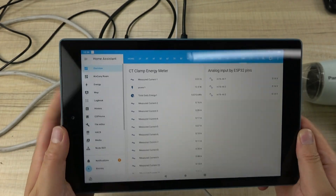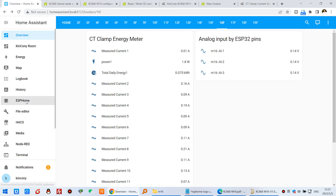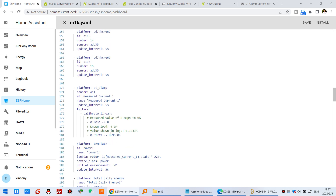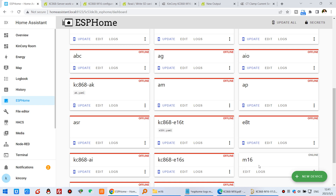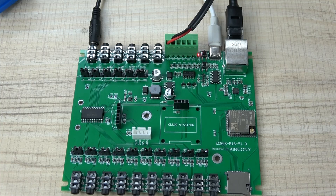This works on the tablet as well. Now I will show you how to calibrate — this is very important. In our ESP-Home configuration for the M16, you will find two calibration values: one that maps to zero ampere, and one that maps to 8.9 ampere. You need to measure the raw output at zero load and at a known load, then add multiple calibration lines for better accuracy. I have connected this USB cable to the Raspberry Pi, so I can use the USB serial log.